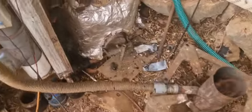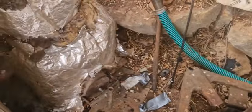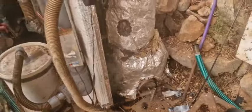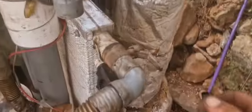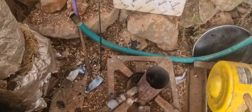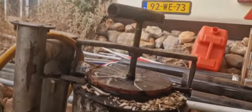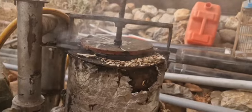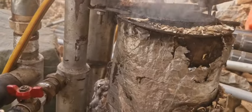I have to stop the test, although this is the raw flame again, by the way. This gasifier is working pretty good, although this wooden board it stands on is getting on fire, so I have to stop this test now. And that's pretty easy with the gasifier. You just stop the air and stop this gas, and then you open this thing a bit so it can vent out the moisture, otherwise it will be a problem next time. You hear that?